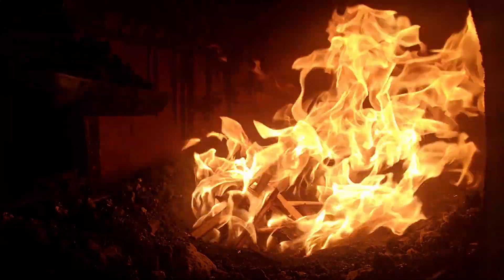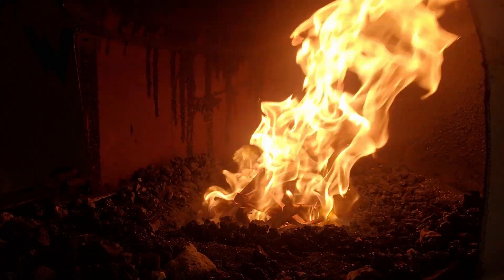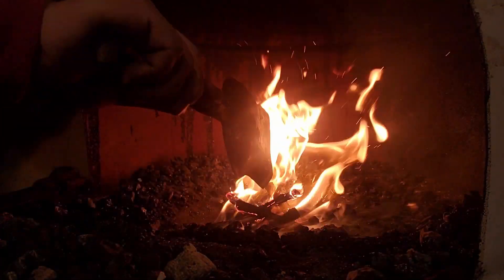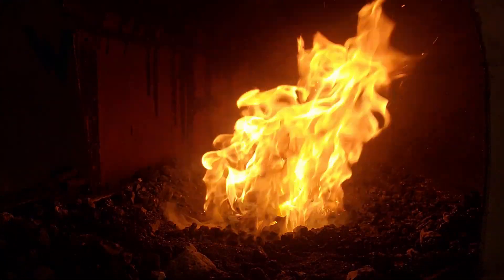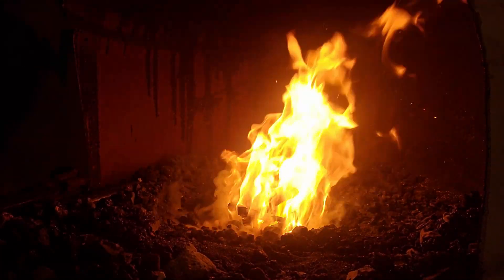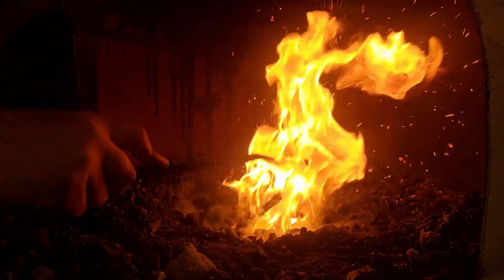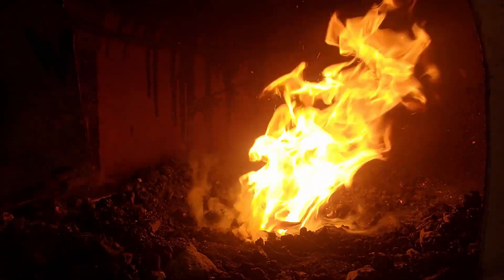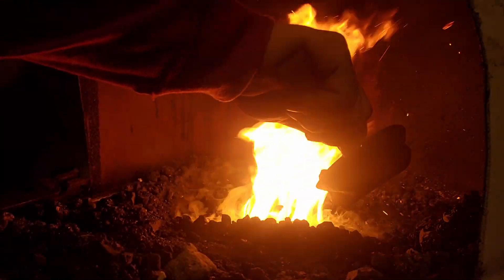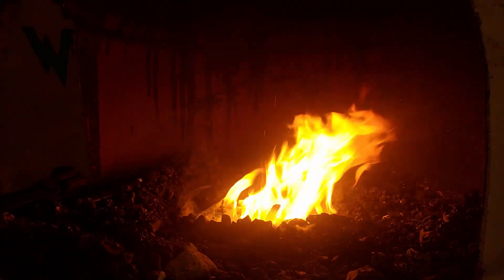Get the fire going. I'm gonna shovel just around the edges, slowly adding around the edges. Let's make sure that fire is laying down and still burning. Start a bit of a pile around the edge — it'll slowly kind of start to coke up. Just a little bit of air; I'm just barely turning the crank here.